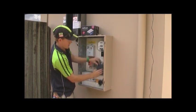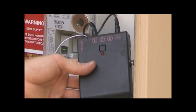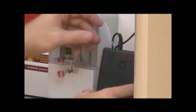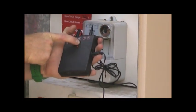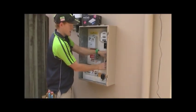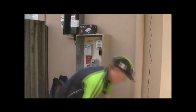You will notice on the front of this transmitter now that the light is flashing. Nine times out of ten, the units will come already paired in the box. If you do come across a unit that's not paired, it will say 'out of range' — you need to run through a simple pairing procedure. What that is: you hold down the button until the light glows solid, like it is now. We now have one minute to get our Watson indoor unit and a small paper clip — I like to use a strand of copper just out of the wiring I have laying around.